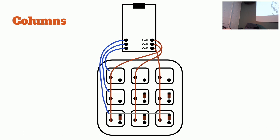So these are now available. If somebody wants to, this may help pull those wires even better. You take this, it's a V-notch, you cut, and then you slightly open it more and use that to pull. Does that make sense? Here, let me show you. Use these to cut through, but don't cut through the wire. Just cut through the insulation and then pull like that.